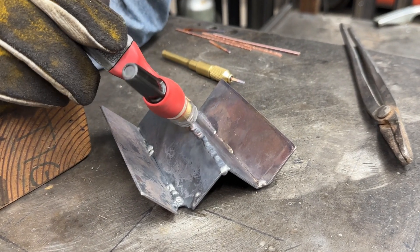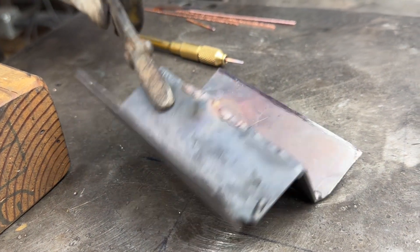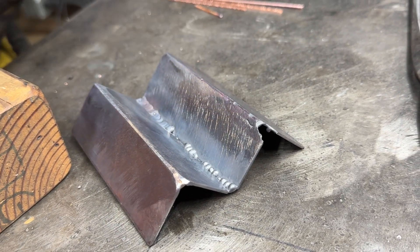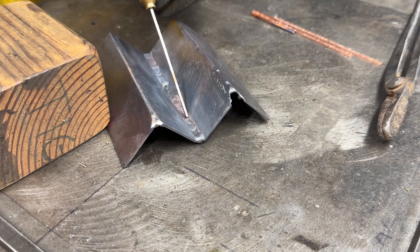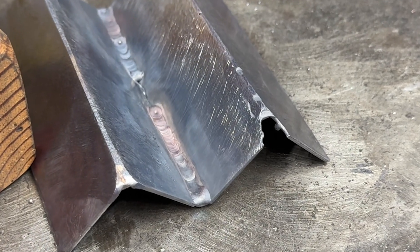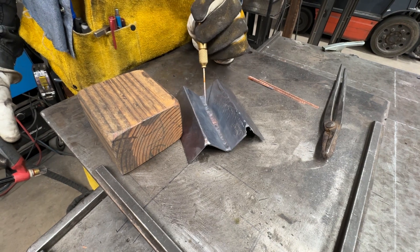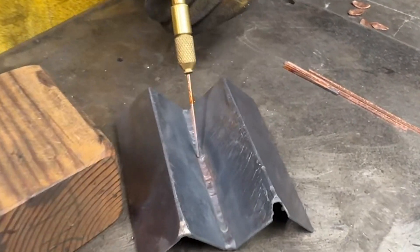I was really pulsing the pedal right in here, and I think with some practice I could get pretty good at it. We're getting really good fusion either way, and with a little bit of practice I can really dial that in. I'm just going to clean this up and try it with another piece of copper to see if I can smooth that out — advancing, then coming back, trying to get a rhythm so it lays down relatively evenly. This last weld was my best weld. Obviously this piece is really hot, which helps a lot — maybe preheat the part if you're going to weld it. I think I'm starting to get that dialed in.